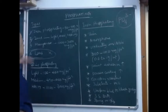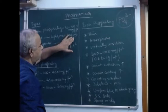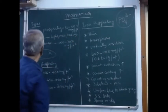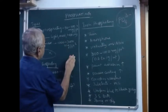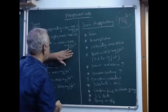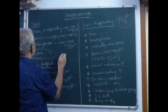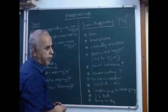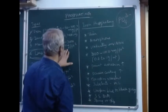Zinc phosphating has light weight, medium weight, and heavy coating weight formulations — so there are three types of zinc phosphate coating. Manganese phosphate coating is a heavy one, exclusively meant for oiling and greasing, not intended for painting. It acts as a very good lubricant, forming a rough and porous surface, with a coating weight of 1000 to 3000 milligram per square foot.